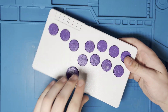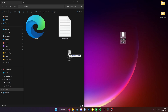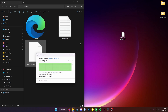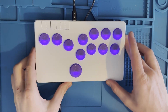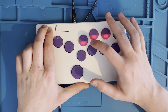Finally we want to plug our Flatbox into our computer. Get the firmware file from the description below and it's going to appear as a USB storage device. Simply copy that file over to the mass storage and then it will disconnect itself and the firmware will be installed. If you have any issues with the Raspberry Pi not showing up, you can hold the boot button on the Raspberry Pi and while holding it plug it into your computer, and it will reset the device and put it into installation mode.